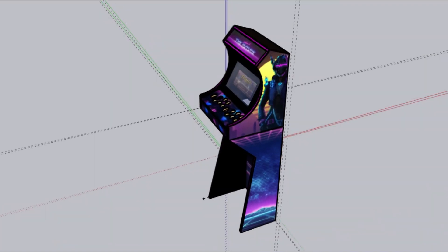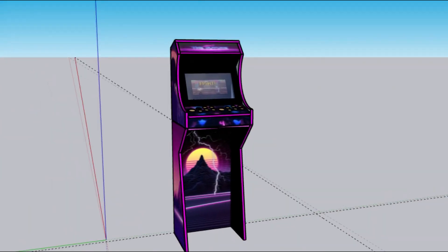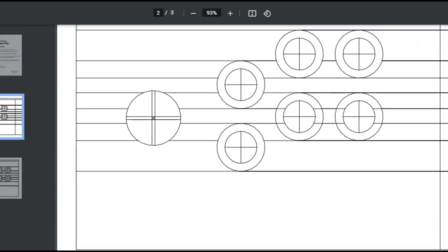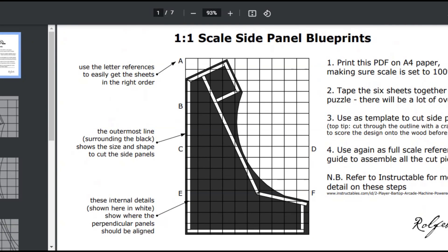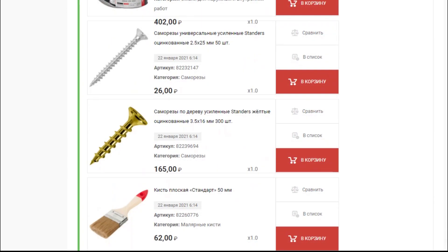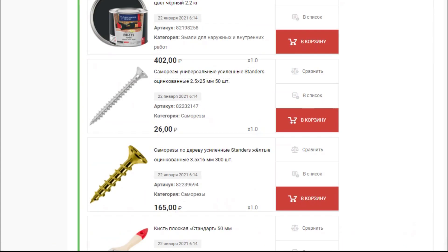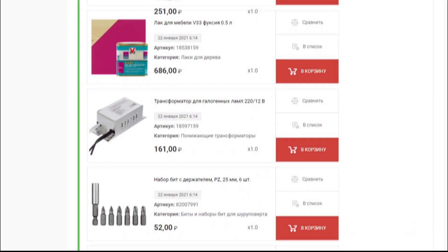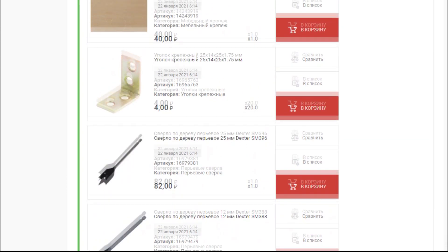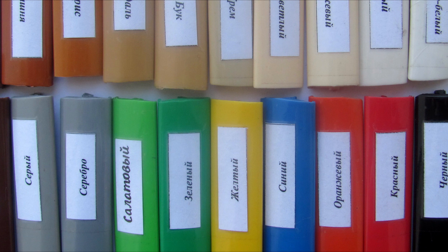The cabinet body will be made from wooden furniture panels, though in principle plywood or MDF could also be used. In my opinion, wooden panels are more massive and pleasant to work with, so we'll go with them. We also make or find templates for precise cutting patterns. We measure and note all dimensions, then order the required length of furniture panels, not forgetting to get hardware — corner brackets, screws, and so on. We also get paint. Pre-painted panels could be used — black ones are always available in abundance — but that's not our case. We get 2.5 liters of black paint and 1 liter of fuchsia for the edges. For edges it's better to use PVC tape, but I couldn't find the right saturated color, so for now we'll just use paint.